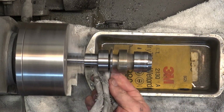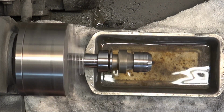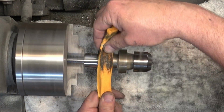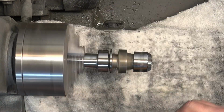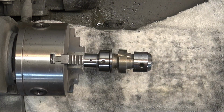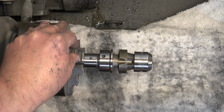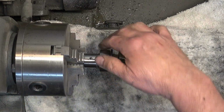Then we're going to wet sand those two sections. Be very careful when you go with rinsing the rag. Stop the rotation if you have to. And then we're going to come back and we're going to polish those sections. And that is the chuck body. I'm really curious to find out what the run out is on this spindle. But like I said, we'll check that in the next video.